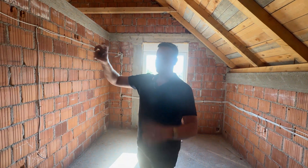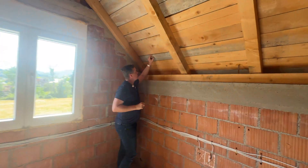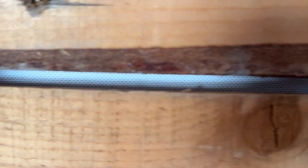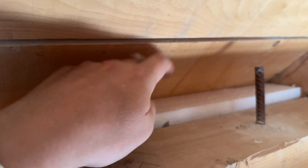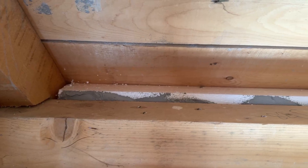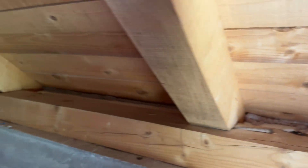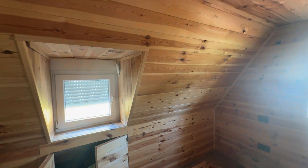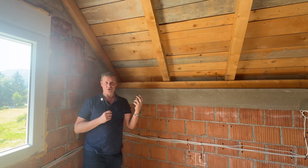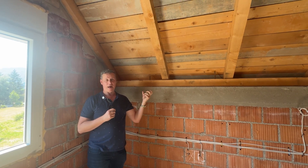All of these internal walls are brick and concrete bracing. Let's have a look at this perimeter detail. The roof has been installed with a wrap, followed by a rigid sort of material which is timber, and then it leads straight into this EPS/XPS material which is rendered on the outside. What I've noticed in a lot of European homes is they use a timber lining on their ceiling. Because this is a very cold climate, you'd want to make sure the insulation consistency and thickness is sufficient. You'd probably want to go with more of a plaster or gyprock ceiling, as opposed to a timber ceiling, which is more than likely going to leak between all of the joints.